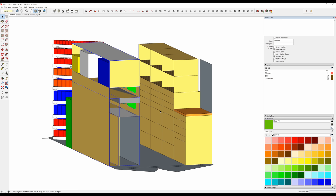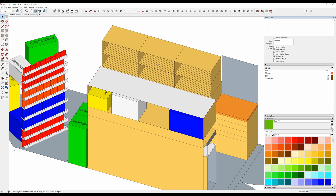These are to his specific sizes. We were making sure as we dimensioned this out — again, this is just the wireframe — that a 10.5-inch opening is not going to be a 10.5-inch deep drawer, because you have to consider the drawer bottom, the drawer runners, and making sure everything lines up. So we came up with this wireframe model over here: all of the drawers, and the top is cubby dividers which has a bunch of dados cut in it so quarter-inch plywood can be slid across.